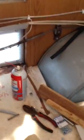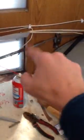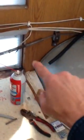All three of those, the corner post, that post, and that post, I replaced that bottom board with a piece of oak, screwed up through the bottom, through the plywood and the metal frame into that board, and I'm going to go back along. There's a lot of spaces, a lot of holes that don't have screws in them, or they've rotted out or whatever. I don't believe they're rotted out, but I'm going to put screws in to tighten that up.